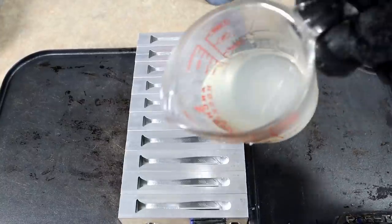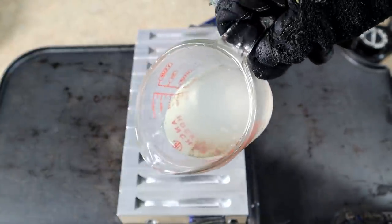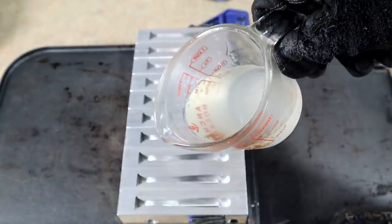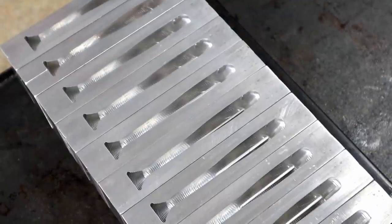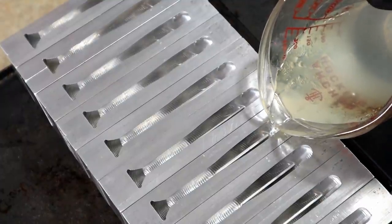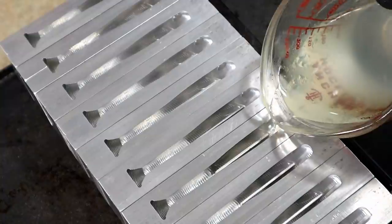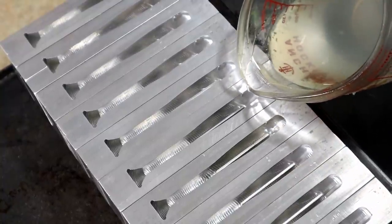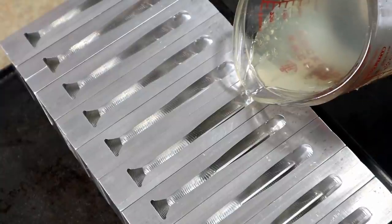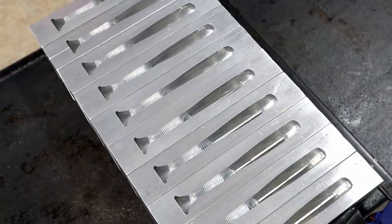The four-inchers are lined up. Here's what's cool about this color - the bottom is just clear plastic, Dead On Plastics black bucket swim bait blend with no pigment in it. Being a fresh bucket of plastic, there's no moisture that's gotten in yet so it's nice and bubble-free, super clear - it looks like water. When pouring in a smaller mold like this, you really have to go slow and take your time because it's easier to over-pour. The mold is smaller and fills up faster, so you can over-pour the belly way too high really fast if you're not careful.